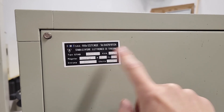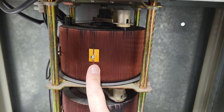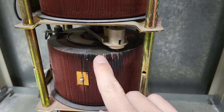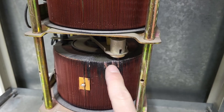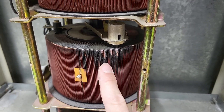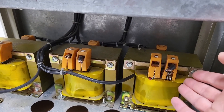From the wire gauge on the windings, it's clear these variacs definitely can't handle 33 amps. And unfortunately, there's a major issue here: one winding is completely toasted. The enamel coating on the copper wire has burned off — most likely this variac had some kind of short or spark.